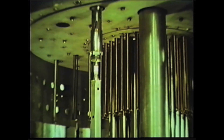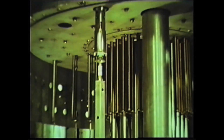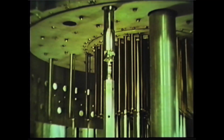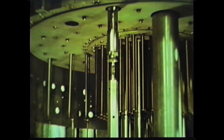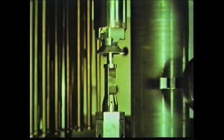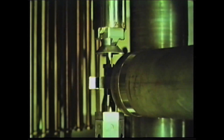The plugs are rotated to move the sub-assembly to the transfer position. As the plugs rotate to transfer, the gripper rotates. This lines up the flat portion of the upper adapter so it can be received by the slot in the carrier block of the transfer arm. The fuel handler at the cap stand moves the transfer arm from its pre-transfer storage position to the sub-assembly on the gripper.